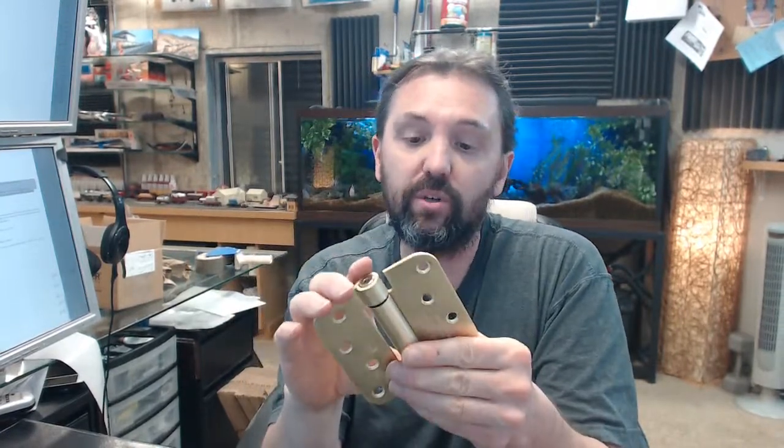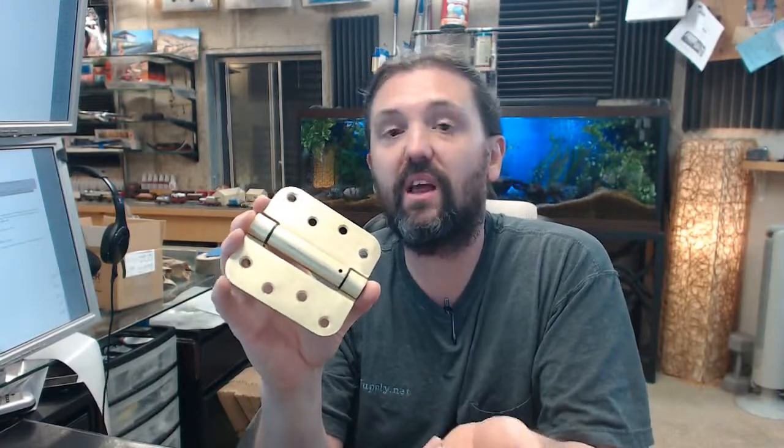90 pounds, 3 spring hinges. Now I'm a fan of all spring hinges. It's not for the obvious reason. It's more so because I've installed these, I've maintained them, I've corrected them, I've reset them, I've replaced them, specified them, from start to finish. I find that you have a greater amount of success at not only getting the door closed, but latched as well when you have more spring hinges doing the job rather than less.